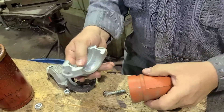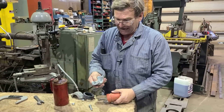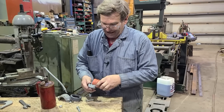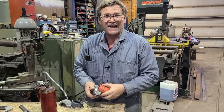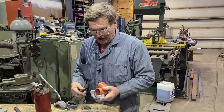Most of the fittings are cast — there were some stamped ones years ago, but most are cast and not machined at all. They do a good job of getting an accurate casting, and they want you to machine the groove accurately. It's not normally needed to be as accurate as they specify, but accuracy is still good, so I'm not going to say to make them sloppy.